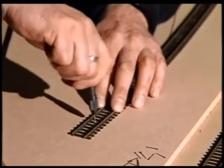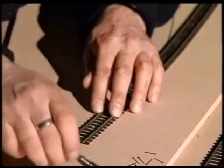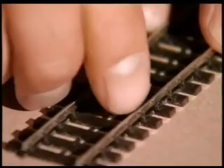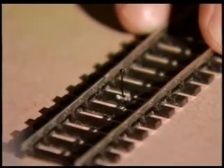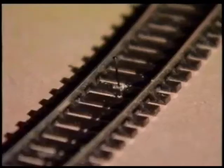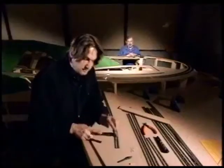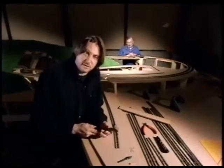You just pop through and drill into the baseboard — it doesn't take very long. Drilling into the baseboard there, that's it. Then you take a pin, pop it into the hole. Here's a tip: start with the large end of the hammer first and then flip it over and use the pointy end just to finish it off. If you use the pointy end first, you end up smashing into the track and doing it damage.